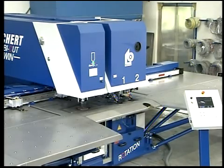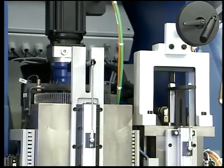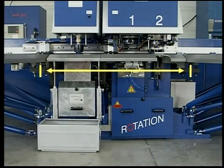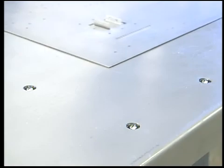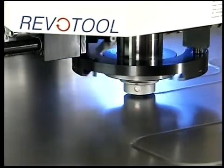The basis of all CombiCut machines is the well-thought-out technology and the robust construction, starting with the solid C-frame and the upper punching head with motor, the toothed gearing, the stroke measuring system and the automatic stripper and indexing mechanism, through to the Trumpf tooling system for standard tools and RevoTool tools. The large distance between the ball spindles on both sides with linear guides guarantees high axial stability and accurate positioning. The repositioning of sheets with a length of up to 10 meters is possible without problems on all CombiCut machines. A distinctive feature of our machines is the repositioning of the clamps without touching the metal sheet. All models in the CombiCut series are equipped with balls in the table, enabling easier handling of heavy sheets on the machine.